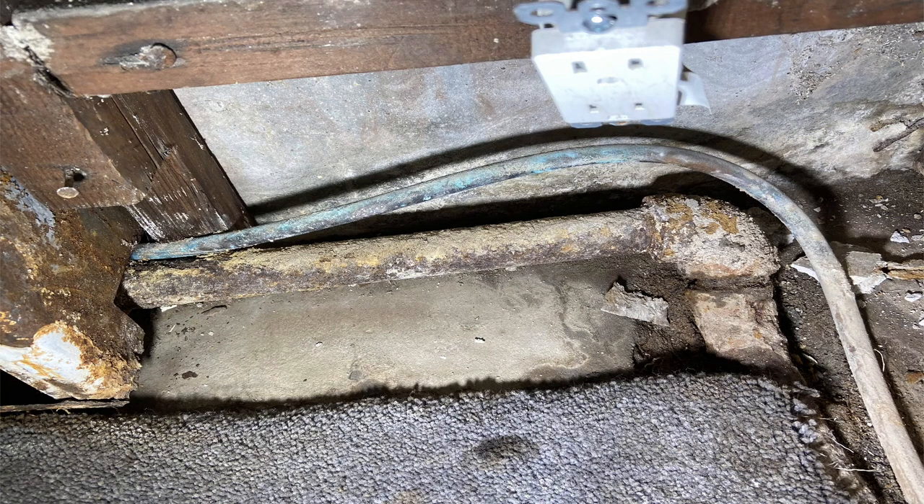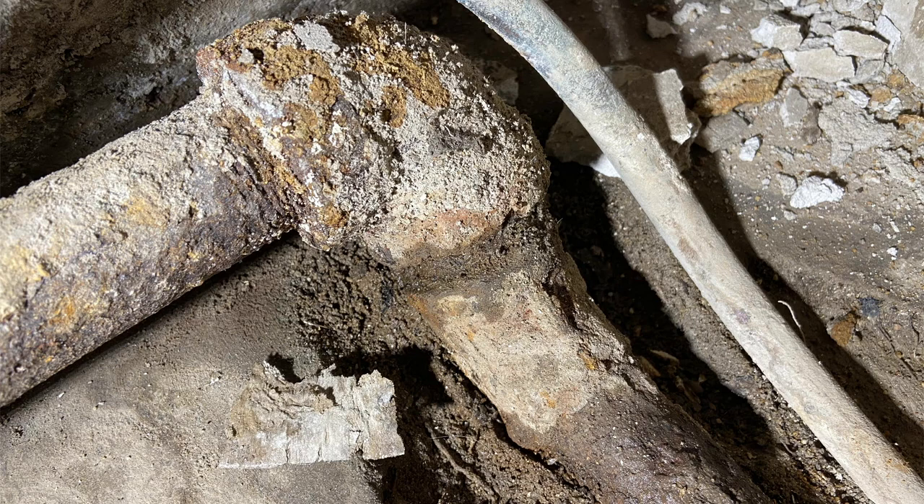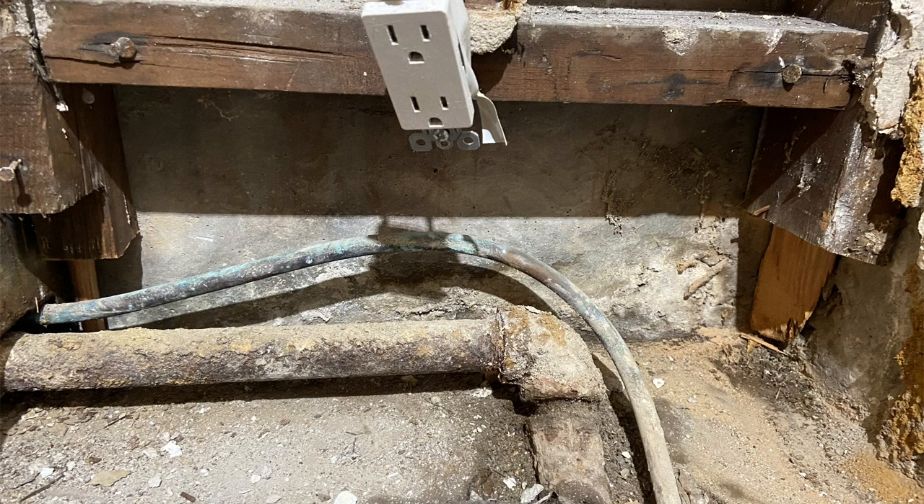All right. So as you can see here, the handyman opened up the wall and exposed this piping for me. I went there and I actually turned the steam boiler on. This is a split system — there's steam upstairs and downstairs. They have a loop going to some recessed radiation with copper tubing, if you can believe it. Take a look at the pipe there, lower left — you can see it's wet. When I bumped up the steam pressure, it started to ooze. So it was apparent that that piece going under the ground in the front portion of the building was compromised.